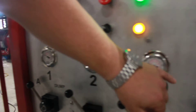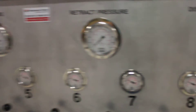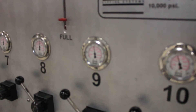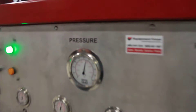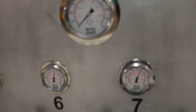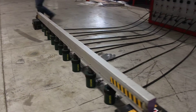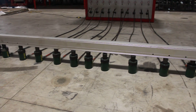We're now visually looking at all our pressures — all rising exactly the same. We've now lifted our beam. We confirm that all cylinders are making contact and all pressures are the same and equal. Our system pressure is an indication of the total load on the entire system. If we were to put a level on this beam, you'd see that it's been lifted vertically level, regardless of any type of weight discrepancy within the area it's being lifted.